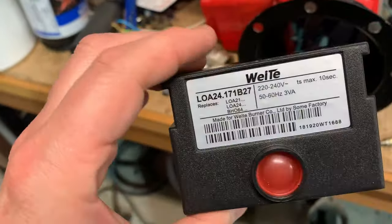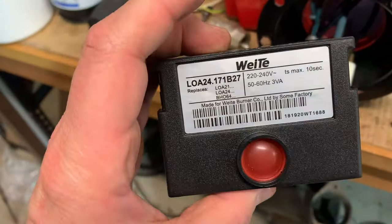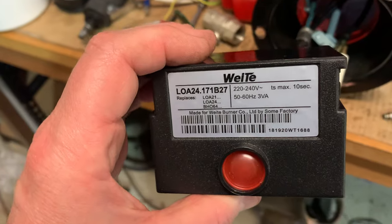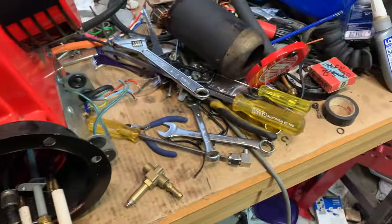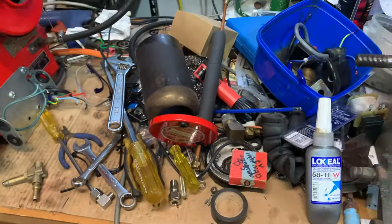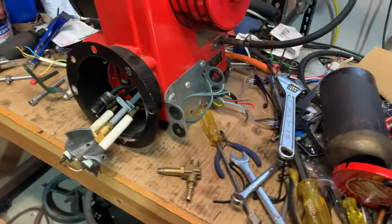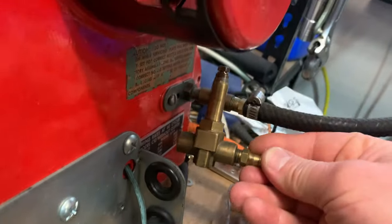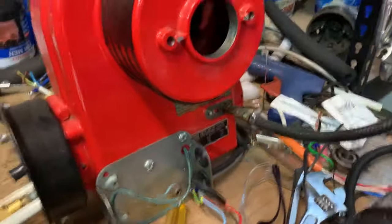It's not really suitable for waste oil because some of these controllers have outputs for controlling valves. It's also got the all-important 10 to 15 second air purge which you need on a boiler, whereas there's no purge on those old controllers. Anyway, this will be our air solenoid and that will go straight on there, and then we'll put an air regulator on the back — I've actually got a mount there for one of those already.